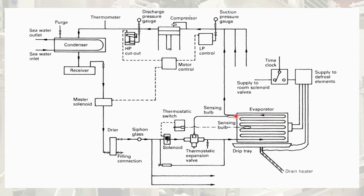After changing the refrigerant to a completely gaseous state, the thermostatic expansion valve capillary bulb senses the temperature at the outlet of the evaporator. If the set point is reached, the diaphragm-operated thermostatic expansion valve will be in closed condition. Then the remaining refrigerant flows to the suction side of the compressor for the next cycle, and a low pressure signal will activate to trip the compressor.